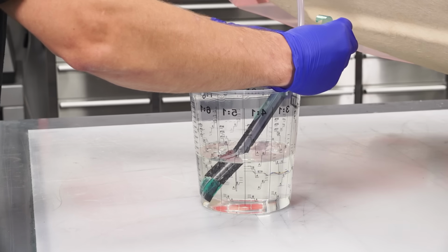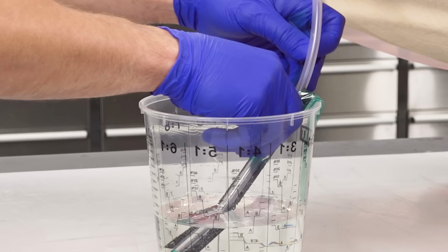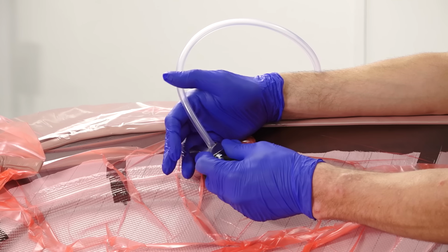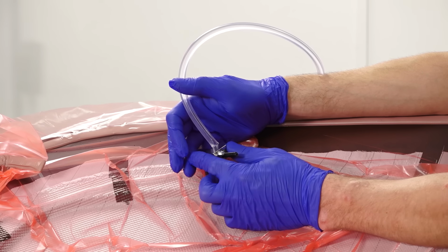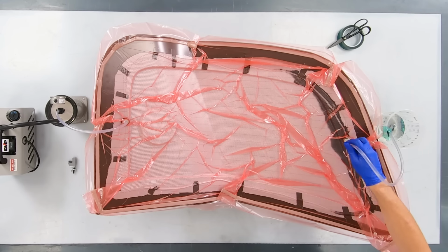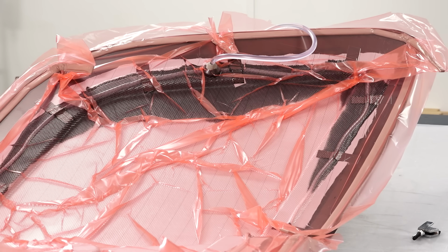The resin feed line should be taped to a stick, and then this in turn tapes into a bucket. This ensures that it doesn't fall out during the infusion. Now you can gradually unclamp the feed line until the resin reaches it. Wait for a few seconds for the air that was in the hose to be drawn through, and then fully unclamp and allow the resin to flow into the part. I've probably done this thousands of times, but I still find it satisfying to watch.